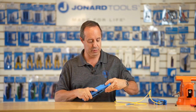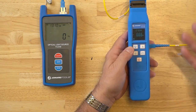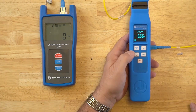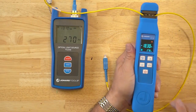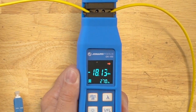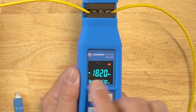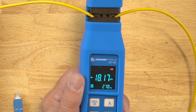It also has a couple other great features. The tool has a light button on it — press it and it dims the screen, but you can still read it. Or if you're in a very bright environment and really need the screen to stand out, press it again to illuminate it. I have my FLS-50 here. Simply take it, insert, and squeeze. You can immediately tell — audible sound telling you direction, the frequency at which pulses are coming in, your relative power measurement, and your battery level. What's really nice is this fantastic screen in the front that's bright and very easy to read.